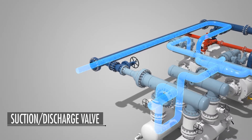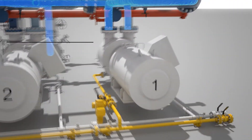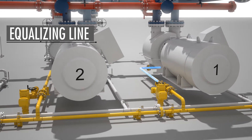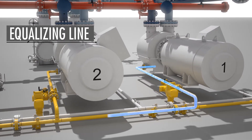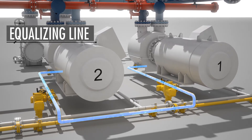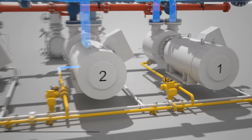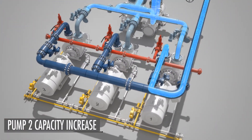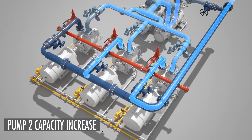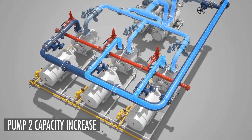Once both flow and drawdown pressure in pump one is established and stabilized, the system may automatically determine that pump two needs to be placed into operation. Upon acknowledging this need, the valves and the equalization line between the two pumps open to assure that pump two has adequate liquid present. A liquid level transmitter within the pump signals that there is sufficient liquid present, after which the inlet and outlet valves to the pump are opened and pump two is energized, placing both pumps one and two into parallel operation. This increases the overall flow capacity and draws the wellhead pressure down to the preset level.